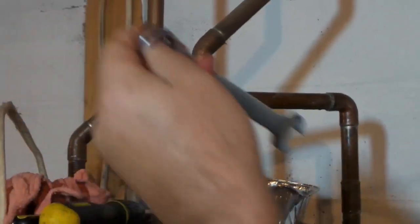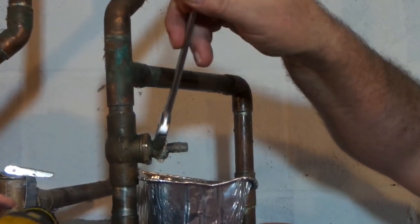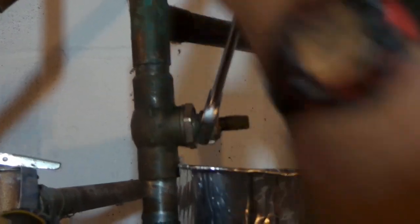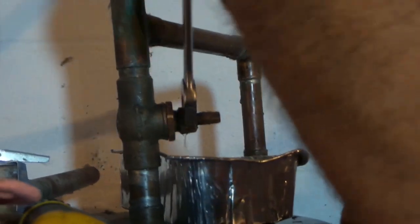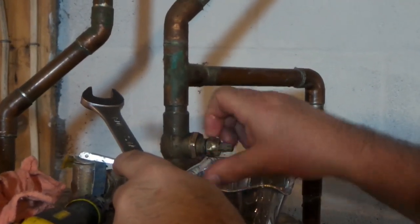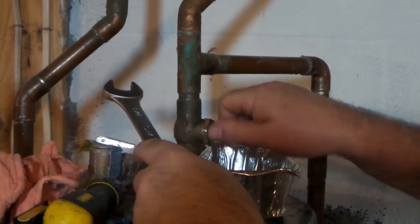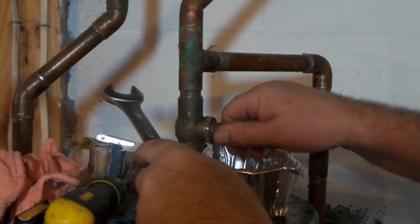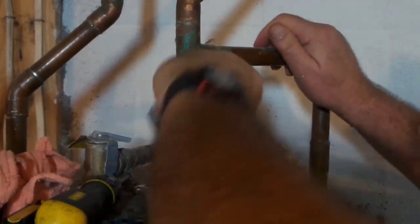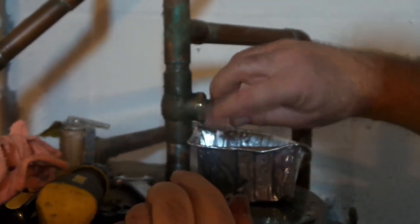Now what we want to do is take a three-quarter inch wrench — that's the size of this packing nut right here — and we want to loosen it. Wow, I thought it would be a lot harder to loosen that. Once you get this off, sometimes there will be a little washer under here that's all corroded. This particular one — that's as far as it goes — so you get it off the threads.